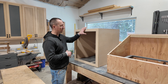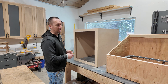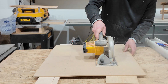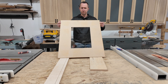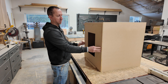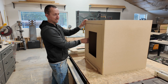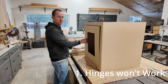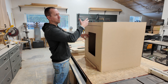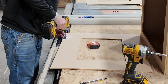For the 3D printer box I'm getting very basic - very very simple. It'll just have a simple door with a nice little window in it, maybe a light so you can see the print. For the door itself I'm going to stick with the quarter inch MDF but cut out the window. The plexiglass I ordered is 12 inches by 16 inches - I'll put that right in the center and it should be a perfect size. I'm going to make a design change: I was going to have the door overlap and basically seal against the frame, but I'm changing it to an inset door. The hinges I bought won't really work with this style door with thin MDF, and there's a bit of an air gap all the way around, which means with a fan we might not have to cut as many holes for ventilation.